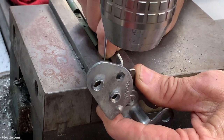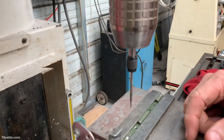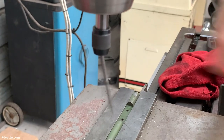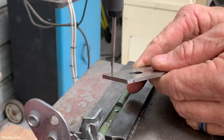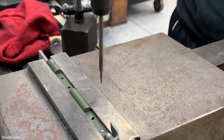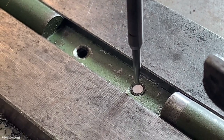Could you push down on that vise handle? That should be pretty close there. I need to run it against it to touch, so it's perfectly straight — it's called a wiggler. I want it to run perfectly true because I'm going to use that as a pointer to come down, and once I stop it, that point should be running pretty true with the centerline of the spindle. So I know if I center that point up with that screw, that centers it up. You have to lock that in. I don't need to worry about this direction because in theory I'm already centered — I'm just worried about back and forth this way.